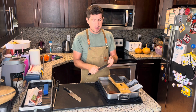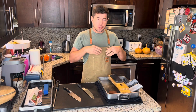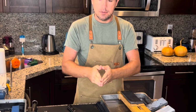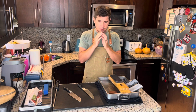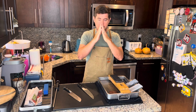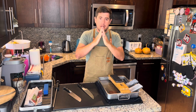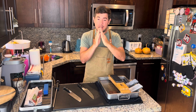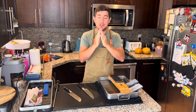And what I'm going to do is try to create a burr. What I mean by a burr is that when you sharpen a knife, the edge is like this, going all the way down. The reason we sharpen is because the edge becomes dull like this. So by having an edge like this, we know it's going to be sharp. Creating a burr happens when you stroke it so many times on one side that the tip of the knife starts curving over to the point where it wants to break off to create a brand new center point edge.